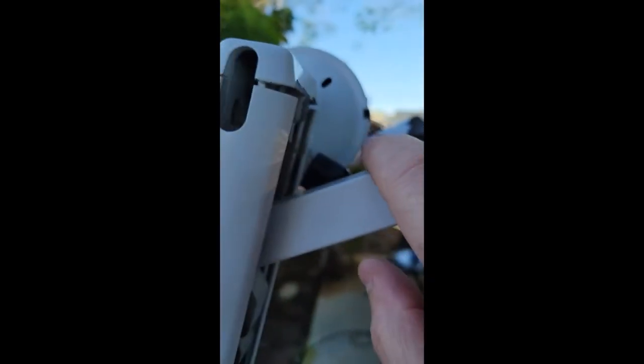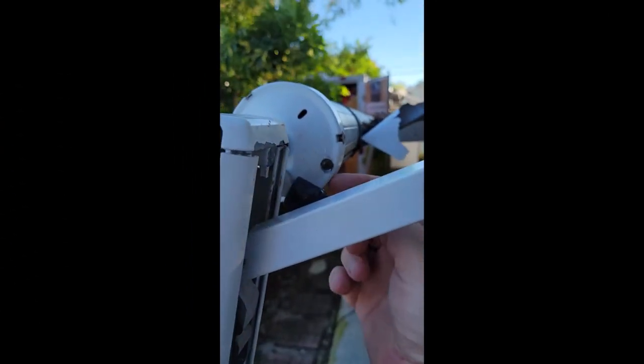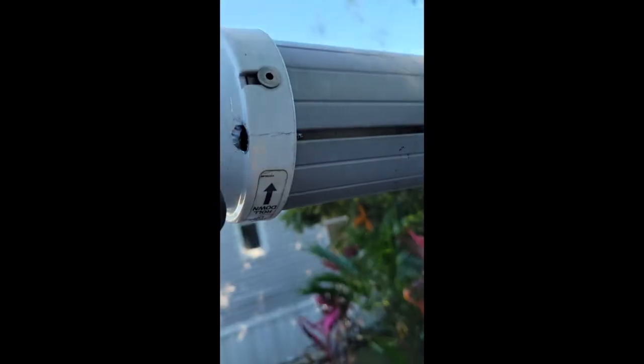When it comes down enough, it'll just hit that screw I put in there. This is still in here and still in the way for the drill, but if you pull down on this or pull out, it straightens up. So there you can see the 3/8ths inch hole. I used a 9/64ths pilot and the 3/8ths drill bit, because that's what the inside diameter of this channel is — it ends up being 3/8ths. I'm going to use my rat tail file to smooth it up a little bit, then take the Dremel and slice that out to the same size as this, which looks like about 3/16ths. It's got to slide in and out, but it's got to be smooth.